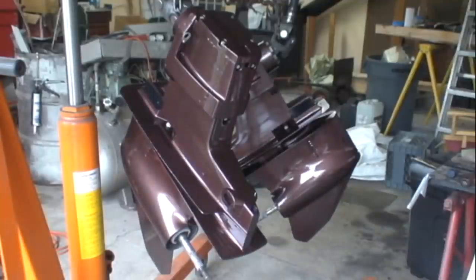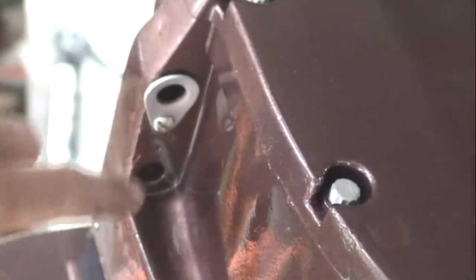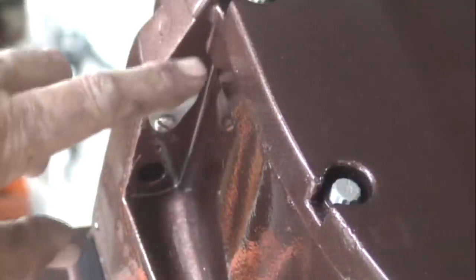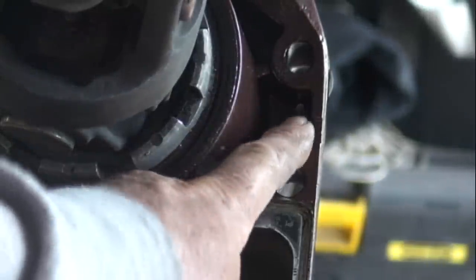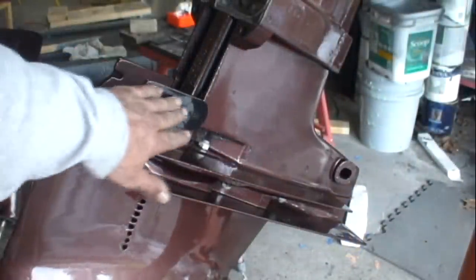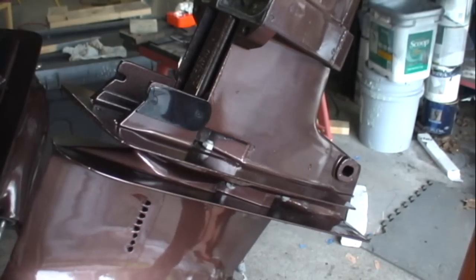It's kind of a weird color but I like it. On both units I had to move the continuity washer from this location — the hole used to be right there — I flipped them over and put them at this location, and I drilled and tapped a new hole, which worked out pretty well. The end of the machine screw can come right into that cavity. I also installed new wear pads; you just slide them in this way until that tab goes in the hole.